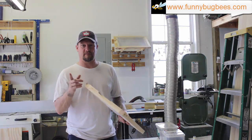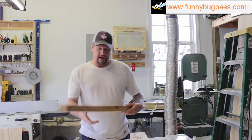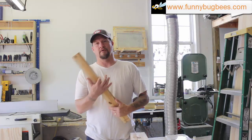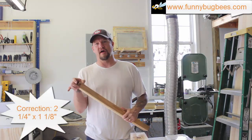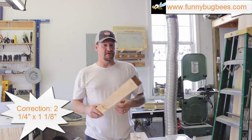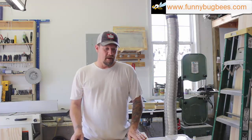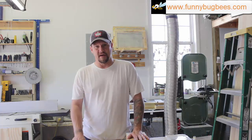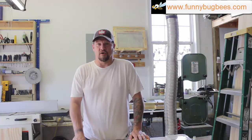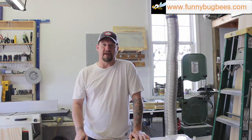So we're going to make this project today. Follow along with us and we're glad you stopped by. Raw materials you're going to use for this project: you're going to need four pieces of lumber — scrap will do. It's got to be at least two and a quarter on one face and at least an inch and a quarter on the other face, so two and a quarter by inch and a quarter. Your long sides are going to be 19 and 7 eighths inches long and your short sides are going to be 11 and a quarter inches long. This is going to be for an 8 frame double screened inner cover. Those dimensions will change for 10 frame, but I'll put that in the description.